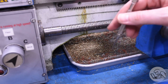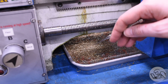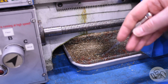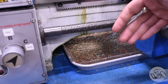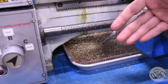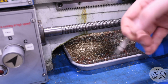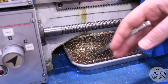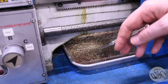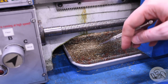There are some safety things to think about when dealing with chips. First, they're typically very, very sharp, so you don't want to touch them with your bare hands. For some materials, like if you're cutting a lot of steel, the chips are likely to be very oily — covered in cutting oil — so they're a potential fire hazard. If the chips are dry, you can vacuum them up with a shop vac. If they're oily, you should dump them into a fire-safe can. Make sure your cleaning regimen involves brushes, brooms, and gloves, and never involves touching them with your hands. The urge to grab a rogue chip off the bench is very strong, but that's when you're going to get nasty cuts and splinters you'll be regretting for the next couple of days.